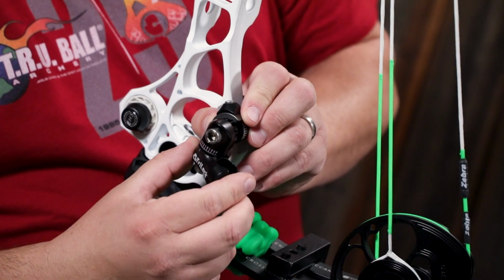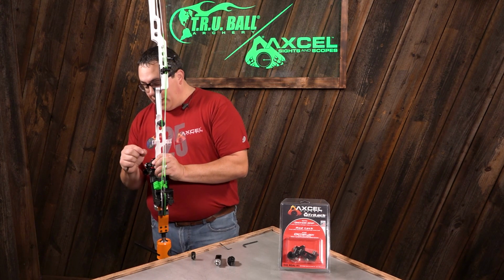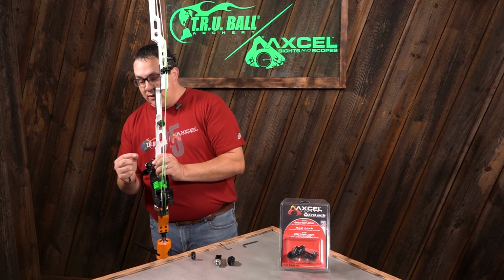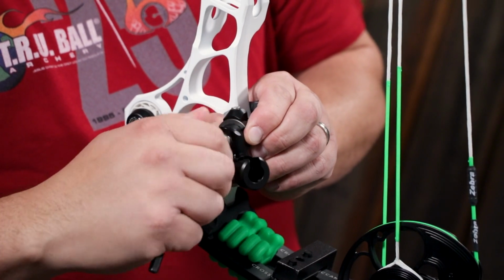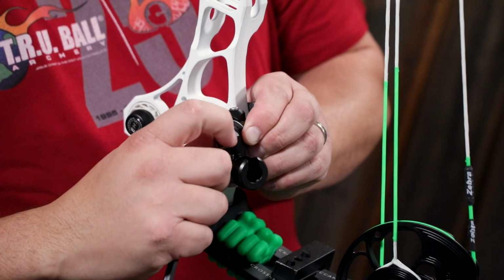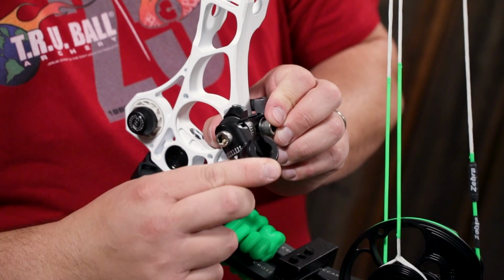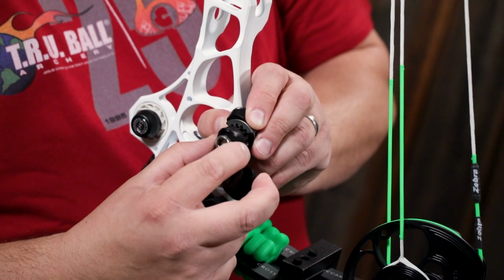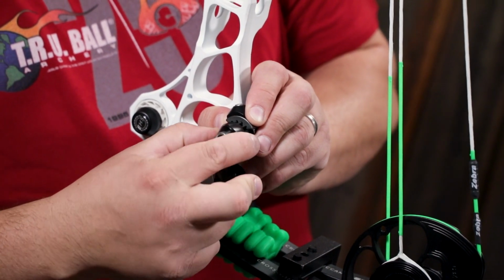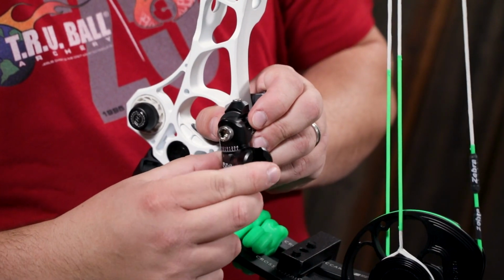Now this is a teeth mechanism to where you can pivot forward and back to select a tooth that's going to lock that down and ensure only what little movement there is, or what little clearance there is in those teeth, to be able to move. So once you move it and find your location, lock your 1/4 inch bolt back down, and you can see that now I'm in the teeth. I can only go that far, 45-degree angle from top to bottom. So if I want to go a little more and I don't get that with the tooth that I selected, back this bolt out again, pull the whole system, the TriLock system, out, select the next set of teeth, lock it back down, and now I have a new range of 45 degrees.